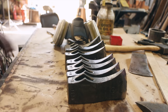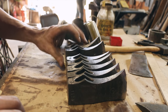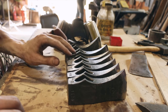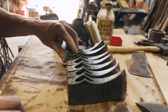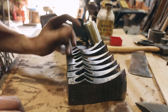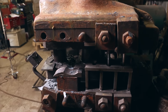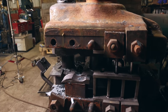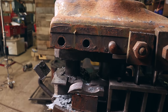So one of the issues that we noticed yesterday is if you look at all these axes, these two particularly, the height is so much different. And that again comes as a problem with making the sheaths and stuff. It's not so bad with how the actual axes look, but where that's coming from is my inability to control the upsetter really finely. So when I squish it, it just randomly squishes it at a height.